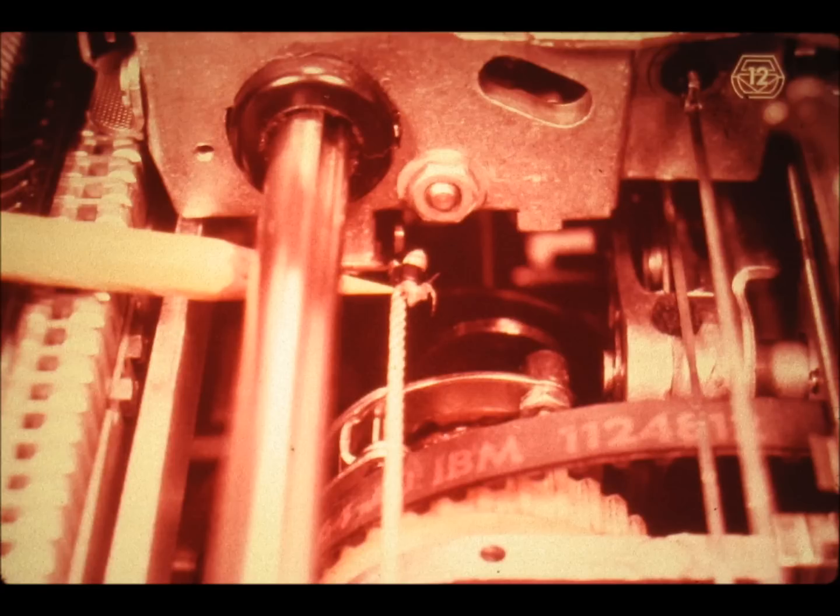And why doesn't the carrier simply move towards the right and relieve this tension? As you look at the machine from above and take a sharp look at the rear of the carrier, you might be able to locate the escapement pawl just above the tip of the yellow pencil. If you need to go to the escapement parts to find this pawl, be careful not to damage the springs. Should you encounter any difficulty, save it for later when we will disassemble the escapement mechanism. Older machines have the escapement pawl covered up so much that you might find it too hard to locate from above the machine.